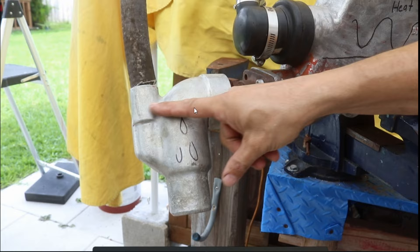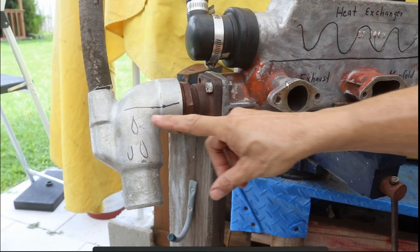This is the point where the gases coming from the exhaust manifold and the salt water coming from the heat exchanger are together. Internally in the heat exchanger and the exhaust manifold there is a metallic division — the gases are not mixed with the salt water, and of course are not mixed with the coolant. The coolant moves in a serpentine path; the salt water passes straight through to the anti-siphon device and then enters the elbow of the exhaust. This is the critical point.